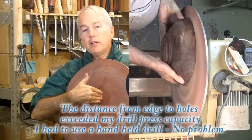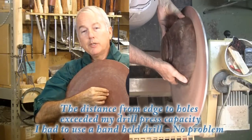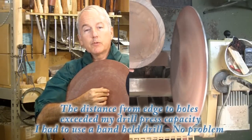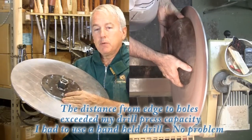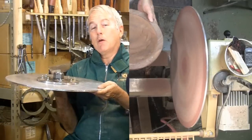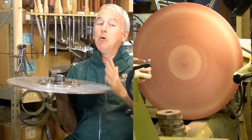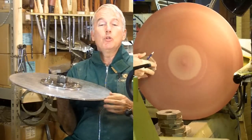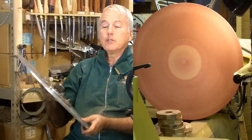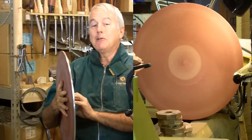Through the surface of the plate I drilled the holes to match the faceplate, countersunk the holes for the screws, and bolted it to the steel faceplate. After that was mounted, I took it over to Howard's again, and with a metal cutting bandsaw — that saved me a lot of work with a hacksaw — we cut it round, and then trued it up with a scraper on his lathe, which is a little bit bigger than mine in capacity. It made it a whole lot easier.